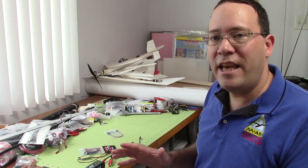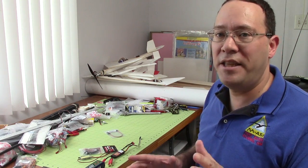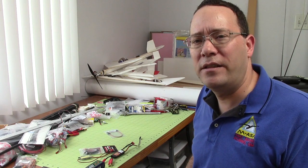Go simple and easy if you can get away with it. But if you have a demanding application — a lot of servos, especially digital servos that are going to be moving a lot — just go with a switched BEC. You'll be happy you did. Until next time.